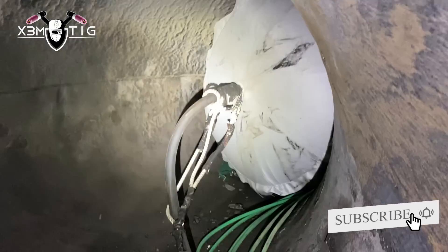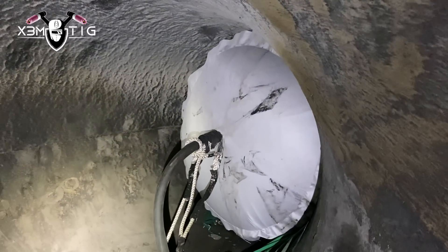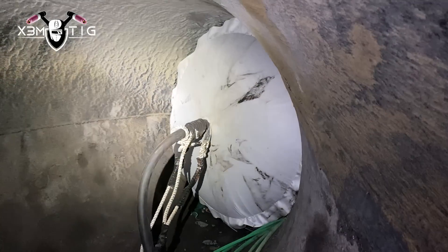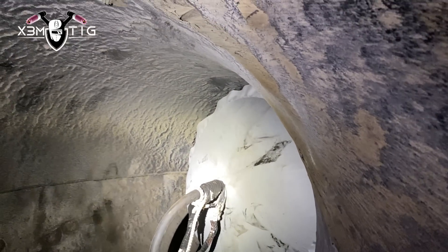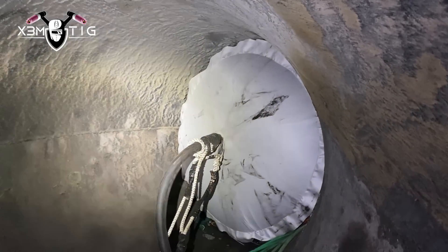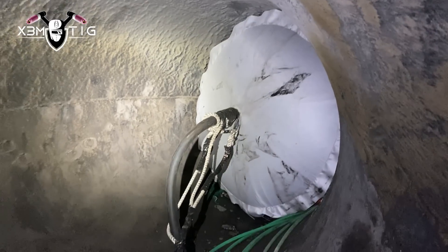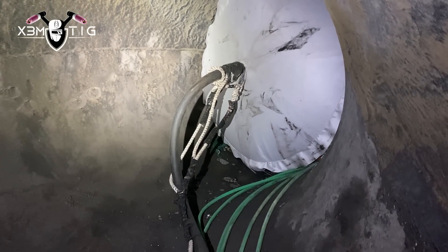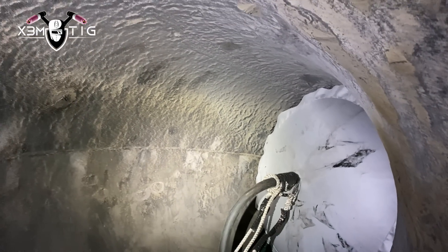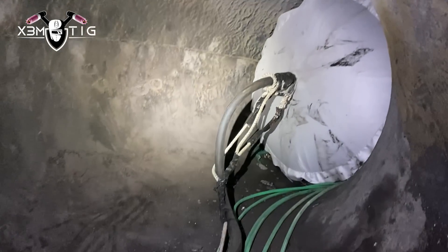This is a custom-made piece. For the purging setup we have custom-made balloons made only for this joint — they were shipped from England for the 42-inch. When they inflate, as you can see, at the bottom part there are around six argon hoses going underneath. That connects to the 90-degree elbow that goes up on the riser — that's the piece that was cut out and has to be replaced. Everything is pretty much custom-made.